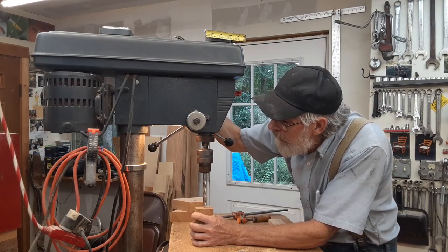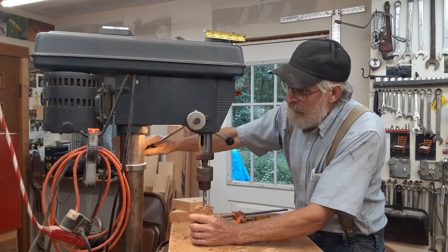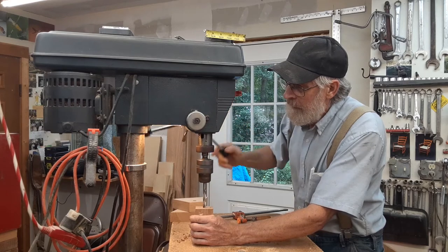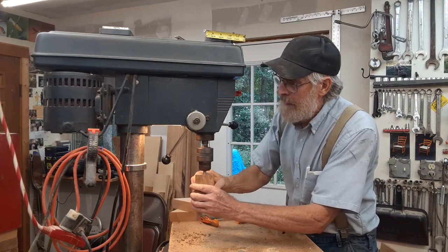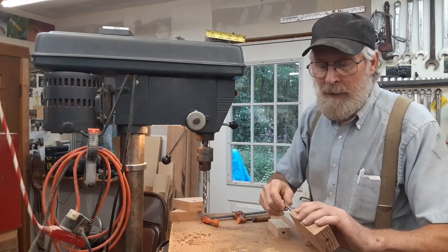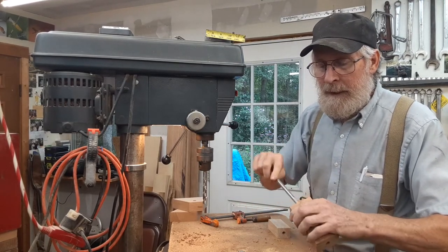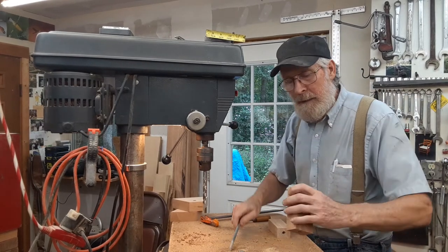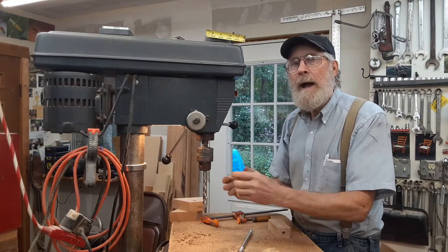Go with the other end and drill from there for a little bit — got to hit that right in the middle. I broke through, but it hardly ever lines up perfectly. I can take this block of wood and go like that. I keep a 3/8-inch bolt up on my magnet to test these holes, and see — that doesn't want to go through. That's an indication there's a burr right on this end, and that those two holes did not meet perfectly in the middle. So you've got to do something to correct that — I'm just going to put this up on there and wobble it around a little bit from both ends.